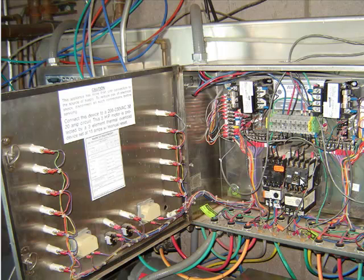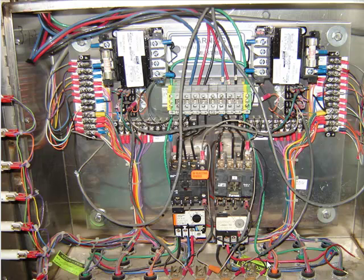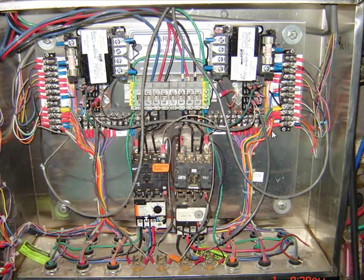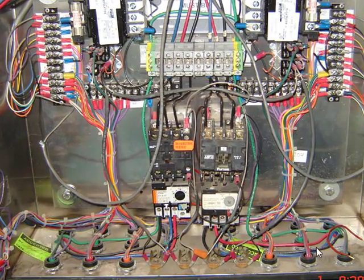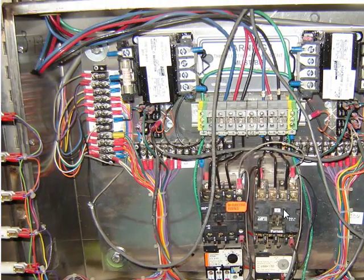Once you get into these and know exactly what each one of these wires is for, you've got corresponding color-coded wires going out, and you can really tell what's going on — as far as the power out there. If you're not getting, let's say, a degreaser, you can trace this back, follow it on down, and these all pop out and go to the individual solenoids. In this case the whole bay wasn't working, so I came straight to the control panel and found that the contactor was not kicking in.